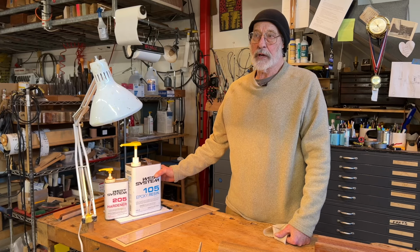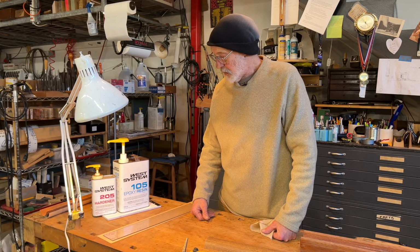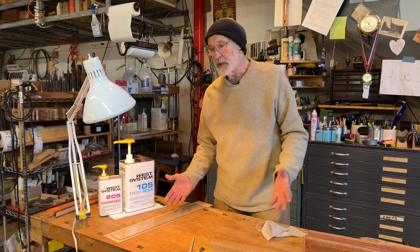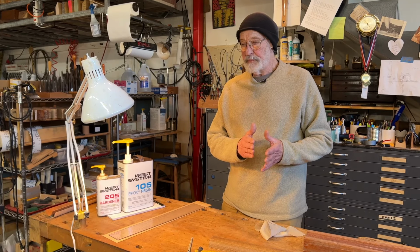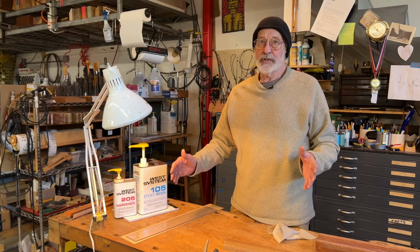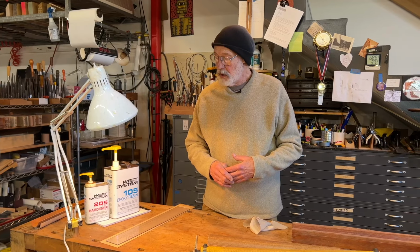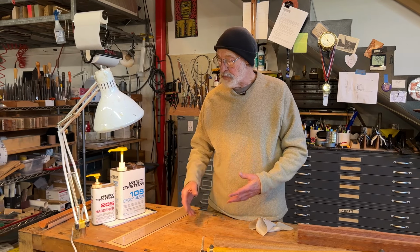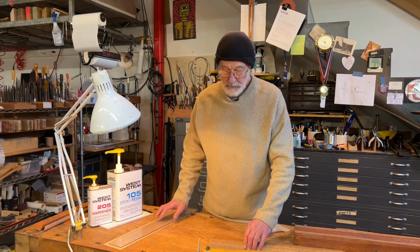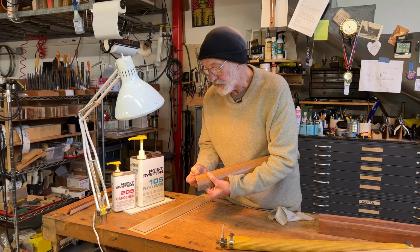And you can accelerate the cure by what we call a post-cure, which is adding heat after that first 5 hours of curing. But what I'm trying to suggest is that there's a moment that lasts for maybe a week or something like that, where the epoxy goes from being cured and structurally significantly strong to the end of its cure cycle, where all of the polymerization has taken place and all the chemical bonds have gone through whatever they're going to go through. Whether you get there by time or by post-curing with extra heat, the end result is somewhat more brittle than it is at the beginning, after it's just been cured for a few hours or a day, say.